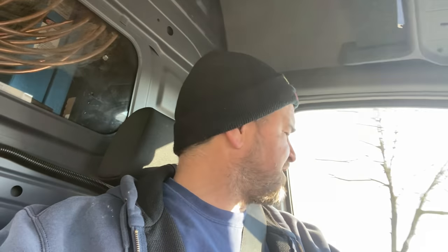And then right before we leave, we give her more information. And that is something else that she didn't know about: hey, listen, you already had two water claims or two water losses. It's time for an automatic shutoff valve. It'll sense the water loss or abnormal water usage, and it turns down the water and gives you a notification. And regarding the backup, because she said they were flushing paper towels down the drain, if we put a sensor in the house trap pit, so if we ever get water there, it's going to turn off the water and stop the backup. And also we could put one in that basement bathroom, which is the lowest point of the DWV system, the drainage waste and venting system.